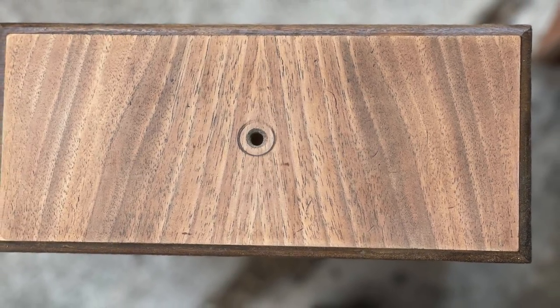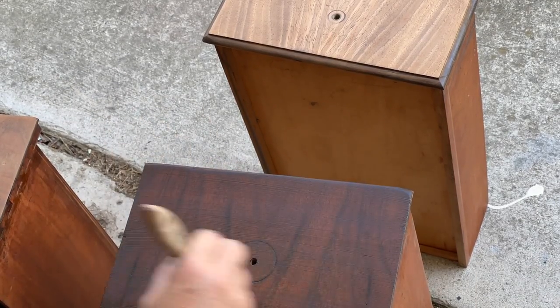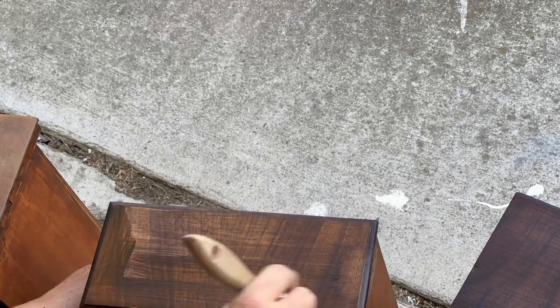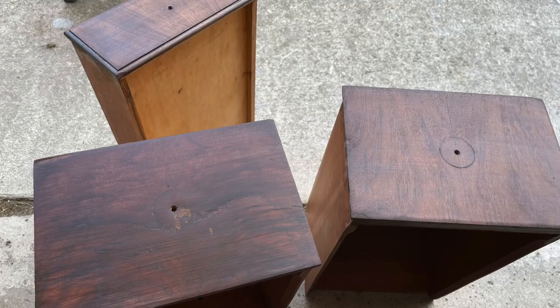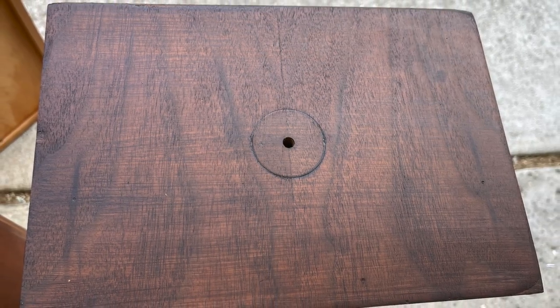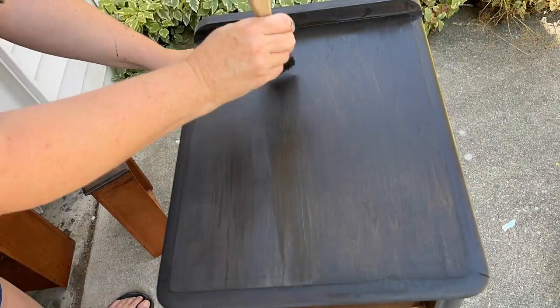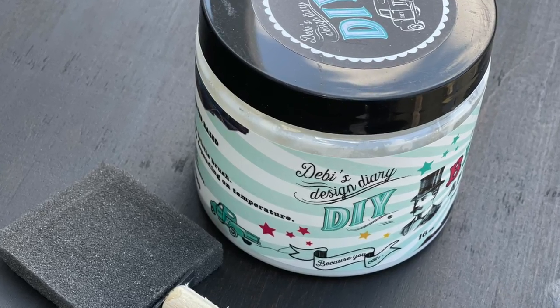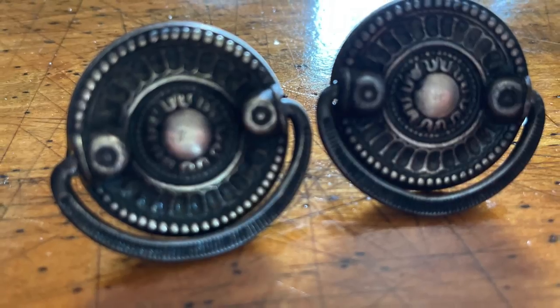The drawers turned out better than expected, so I'm just going to coat them with DIY Dark and Decrepit. Although I like the finish, I would like a little bit more wood tone, so I'm going to add Dark and Decrepit over the top. I really like the look of it now — we've got that brown wood tone with the black wash, but in reverse. Time to seal: I'll be sealing the top and the drawers with DIY Paint Big Top, which is a great durable, non-yellowing finish.